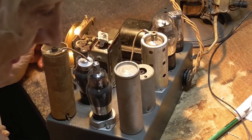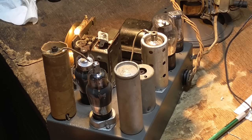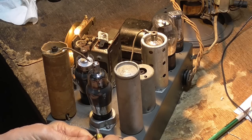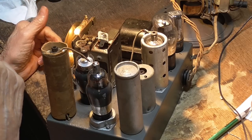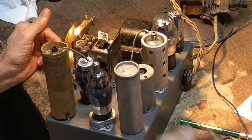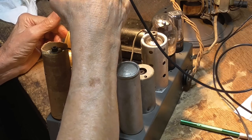Connect the generator, one lead to ground, and one to the antenna terminal. When we do that, no matter what you connect to the antenna terminal, you should get a big scratching noise. We get nothing. So we've got something wrong here. Okay. All right, we're going again. The scope is going. Okay, that's going to be the input.